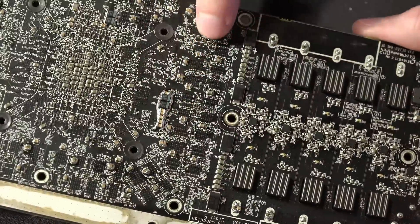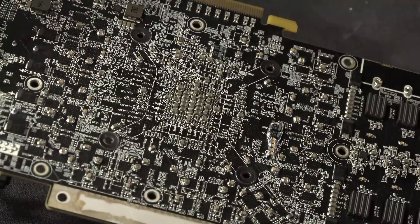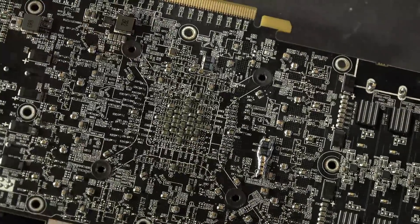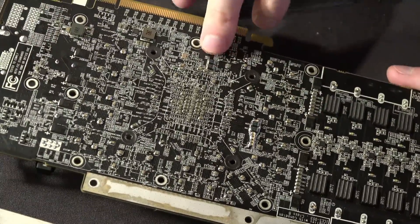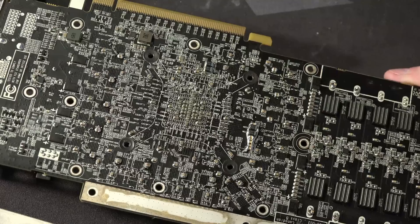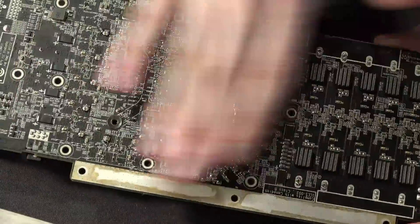Other than that, I've hit basically every single memory chip as well with some extra capacitance — that unfortunately I'm not sure has any impact. It's like a couple megahertz, because after several rounds of cap mods, I think when I had the card bone stock I was benching 1675, and eventually I was running 1685 with the card in this condition.